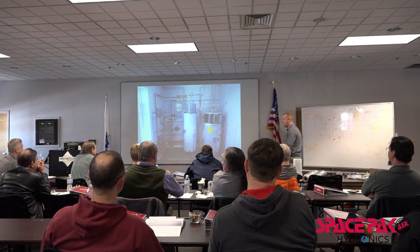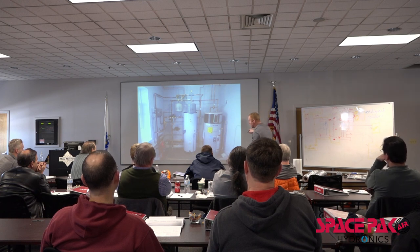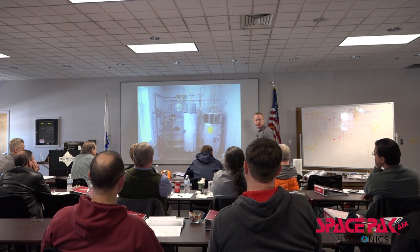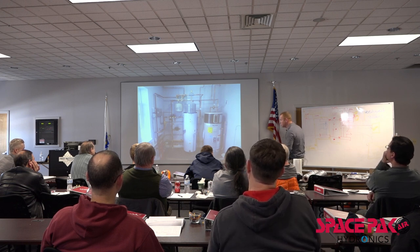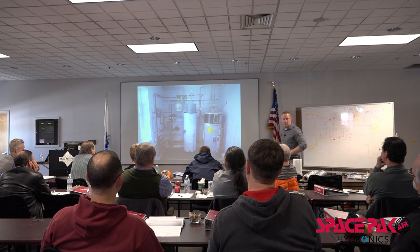Here's a project, right? Where the sole form of heating is outside, it's our low ambient heat pump. Inside, we're pumping hot water into this tank. Coming off of that, we have two circulators. One circulator goes down to a radiant slab. I think the load on this whole house was like 16,000 BTUs, if I remember. It wasn't much. You could, you know, a couple of birthday candles and you would have been set. And the contractor put some low temperature baseboard upstairs. This unit runs fantastic. Okay? Sole form of heating and cooling.